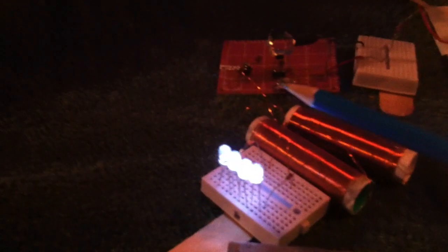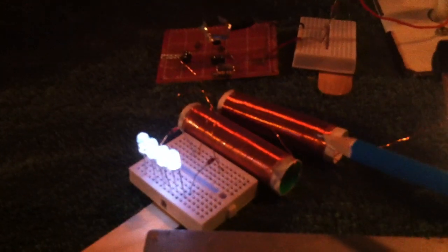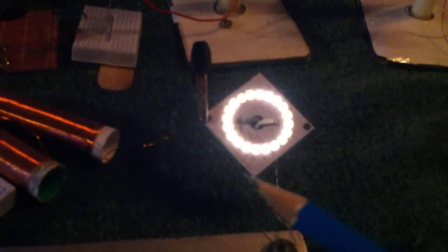It comes over here and is received on the receiver tower with this crystal oscillator circuit that we've been working with. It's a 13.56 megahertz crystal — a circuit that comes in from an AV plug attached to this receiver tower. Then it goes through this basically L3 type of coil, only mine's longer, and then it comes over here to the back side of one of these 110 volt LED lights. The AV plug is put to the ground — the virtual ground.